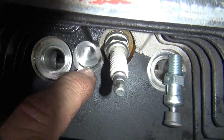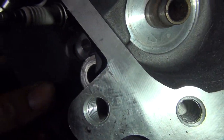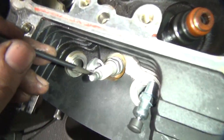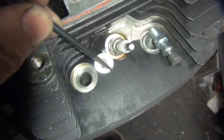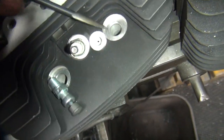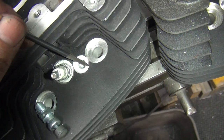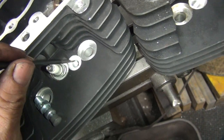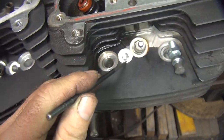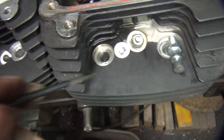So you can see how mine's almost nothing right down there. And theirs is pretty close too also. About 30 thou high there. They're definitely a lot higher. So they could have pulled theirs up probably 30 thou, they didn't go as deep as they did. So I like how my hole's close to the plug hole over here, but that's just a looks thing for me.